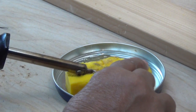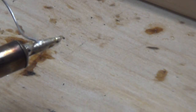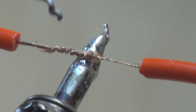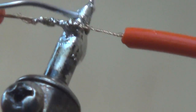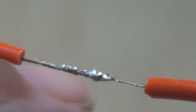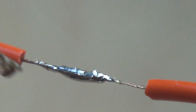I've cleaned it off a little bit, and now I'm going to wipe it off. Okay, so it's clean. Now I'm ready to tin it. This is tinning the tip — applying a light coat of solder to the iron. I'm pretty satisfied with how it's looking now. Perfect.